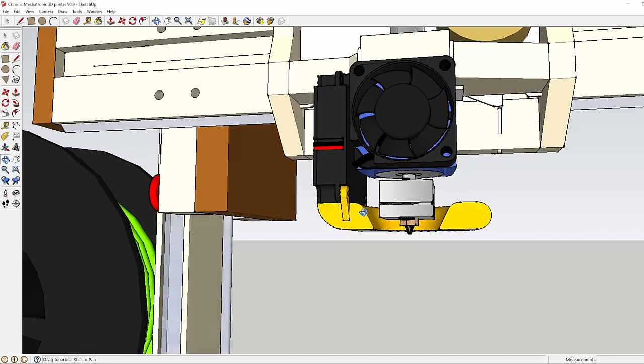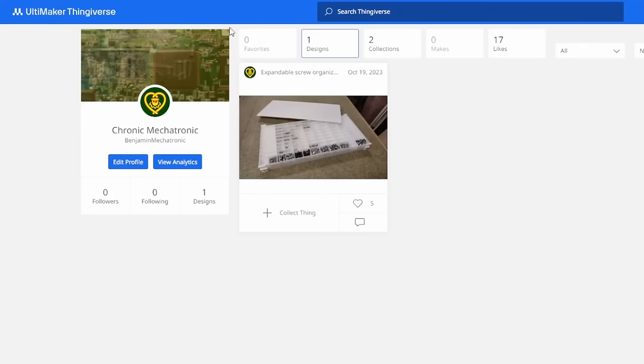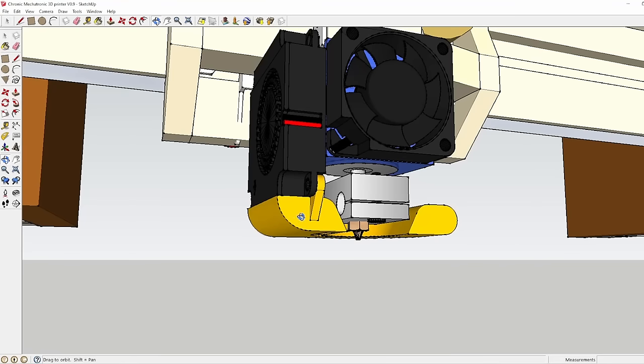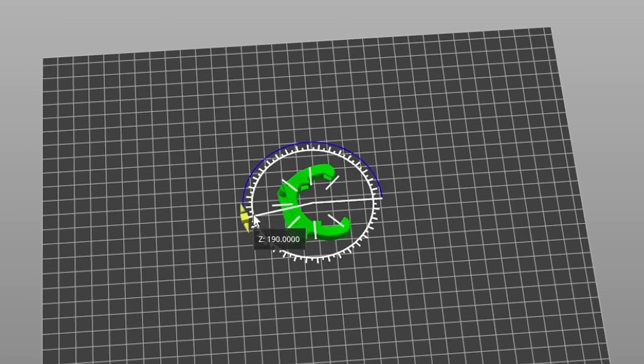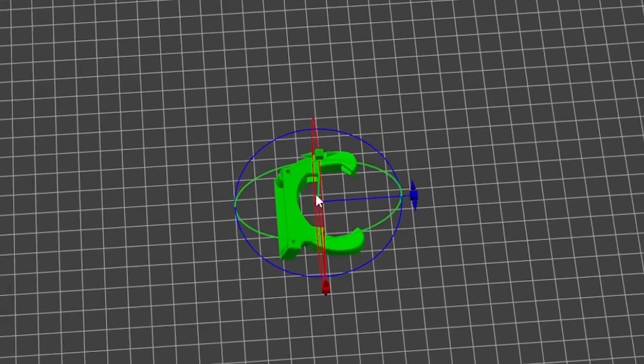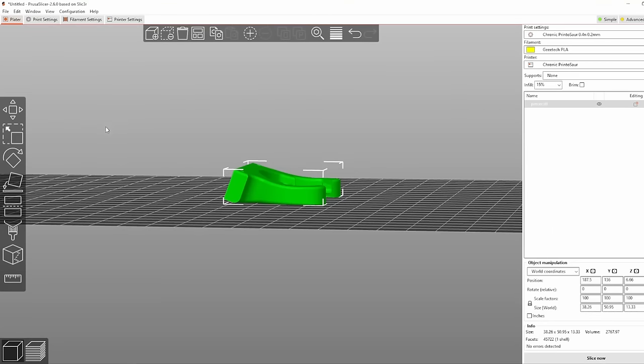Though if you don't care about sending the airstream around a 90 degree curve, I'm going to leave mine on my Thingiverse in the description just in case it could be of use for someone out there. I'm going to slice it with the fan opening facing the left hand side, that way the only effect my constant layer shift should have is the fan angle being slightly reduced.